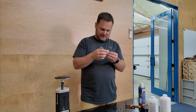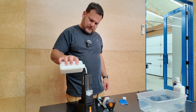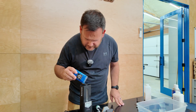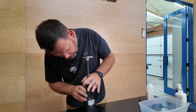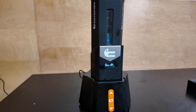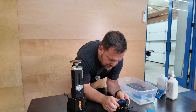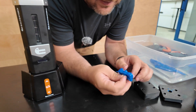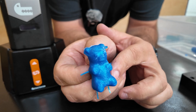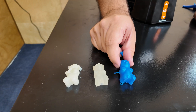That was a win, but I wanted to see how it handled color next. For the next round, I mixed some colored mica powder into the soft gel formula. I ran the same cycle — 10 minutes to heat, three minutes to set. I opened the molds and the result was these colorful gummy bears. So in less than 15 minutes, I had clean little gummy bears, first in natural clear and then in custom colors, just by adding a little mica powder.